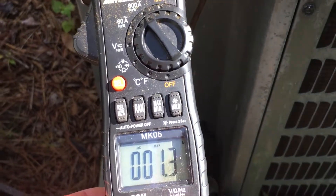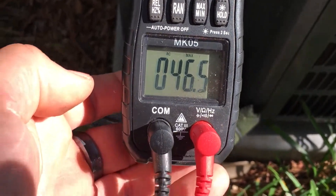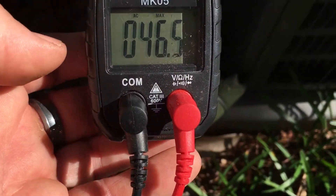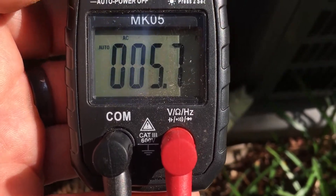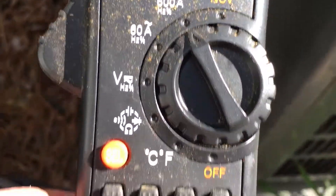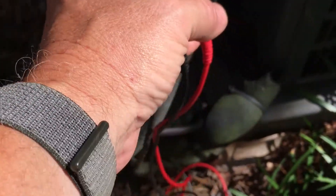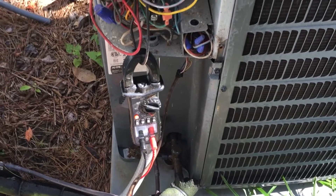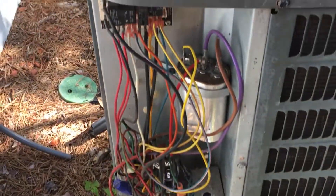Everything's set up and we're just waiting for the AC to come back on. When it kicked on, this second meter says 46 amps max, with running amps at 5.7. The resolution is slightly different because it's set for 600, but the running amps are about the same. So we have our two baseline measurements from two meters — numbers will be relative to both when we switch this out. Next step is to go ahead and install the soft starter and then re-measure.